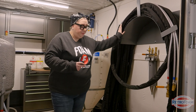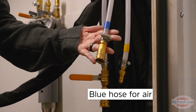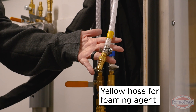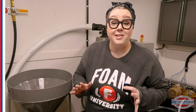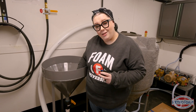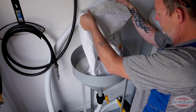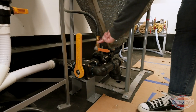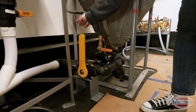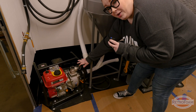Right here you can see there are hoses — we've got the red hose for resin, the blue hose for air, and the yellow hose for the foaming agent. Now this is where the real magic happens. The crews are going to pour the dry resin product into this basin, which serves as a funnel. Dry resin product goes down through here, and crews are also going to hit this switch over here, which is going to pump water in.